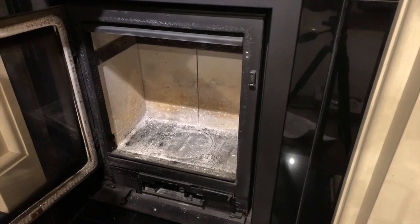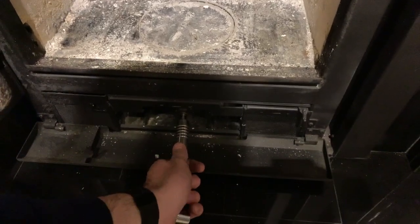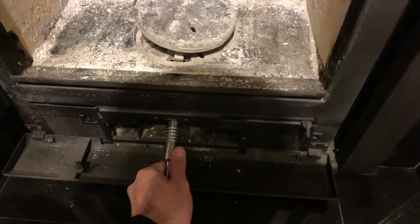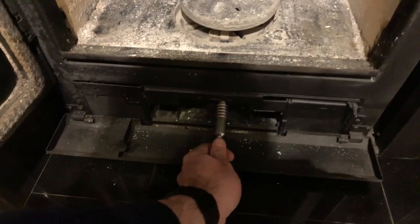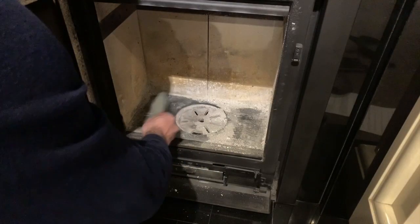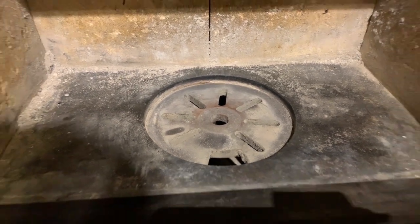You can rectify this issue by firstly following the steps in the previous tips, and using the handle in the centre grate, carry out a push upwards and back action to release the grate. Once the grate is released, remove it completely and clean the area well with a brush or a vacuum, and simply position the centre grate back in place with the handle first and allow gravity to find its proper placement.